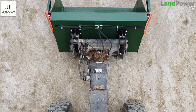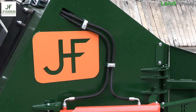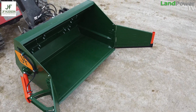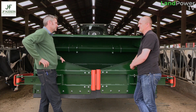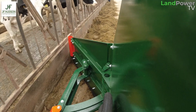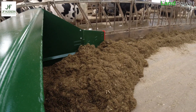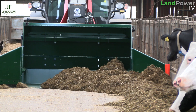The routing of the hydraulic pipes is better on this one - just around these corners, around the back, we've gone sort of through the bucket. That's adding strength but also giving the pipes a bigger radius. There's a lot of weight on the front of this bucket because of the doors, so the sides are engineered to take the weight of them, but they also get put under a lot of stress. You're literally pushing into stuff, so there are stresses through the doors coming back at you. If you run into something, it's a fair smack going all the way through.